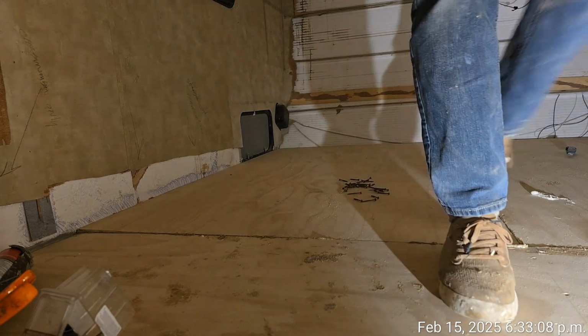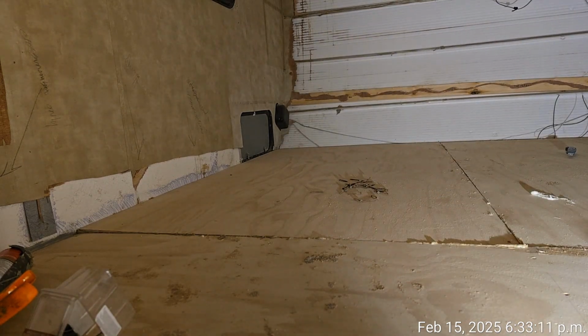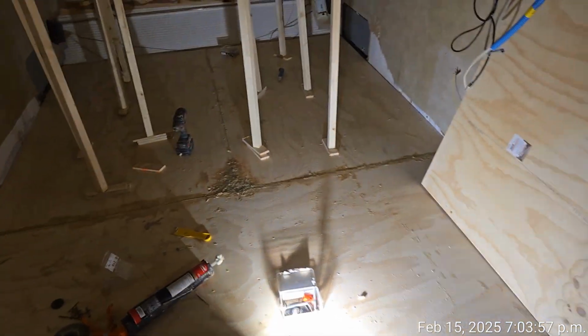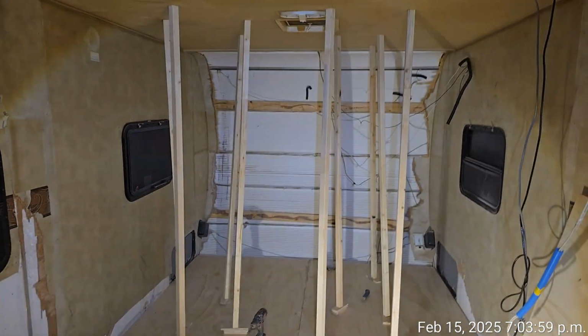And then in the back, I use longer screws because I got 1/2 inch of plywood up top. Then I got my 2 sandwich pieces of wood, plywood to get that flush. And then I have my cross member I built out of those 2x6s there. So those are gonna go with these 3-inch screws on the back to get through there. But yeah, that's it. Oh, there it is, all shimmed up.